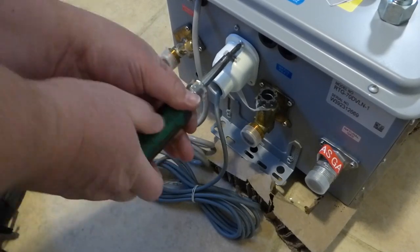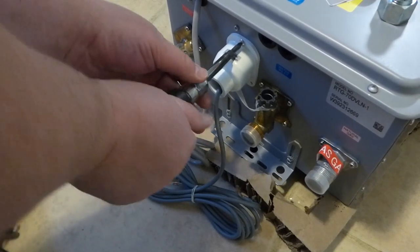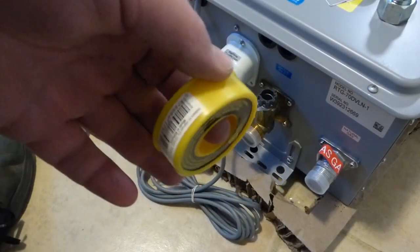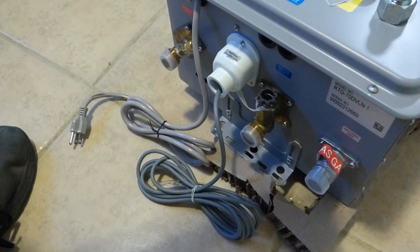The next part is what I like to call a tale of two Teflon tapes. Most people of course have seen this one here — the blue and white covering. And there's this stuff here — yeller. This yellow Teflon tape is actually good for gas lines, natural gas, propane, butane, and kerosene. So you've got the natural gas spigot down here, this little cap will be coming off that, and I'll be wrapping this on.